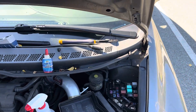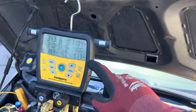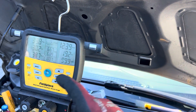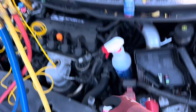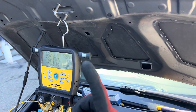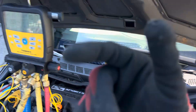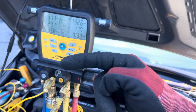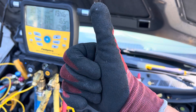Let that run for a while while I go get another relay and throw it in there, because I cannot take good superheat and subcooling measurements or pressure measurements with only one fan. It will cool and it will work, but it won't be right — and on a really hot day it will be bad. I'll come back; there was one video before this, and let's come back for video number three.